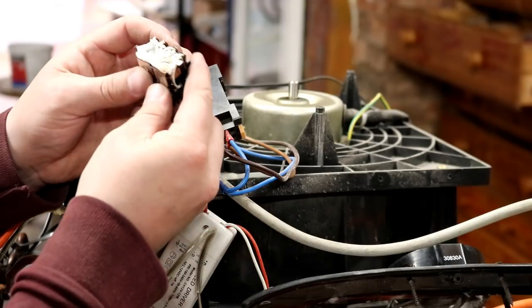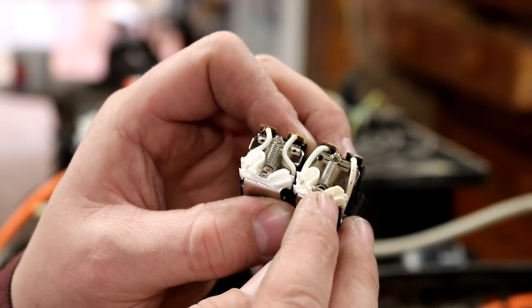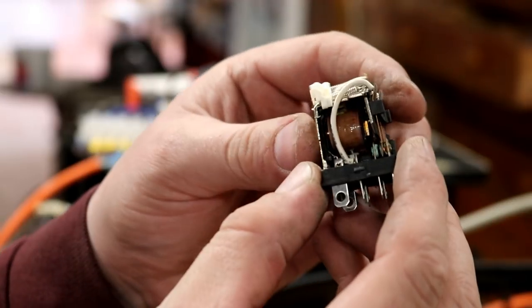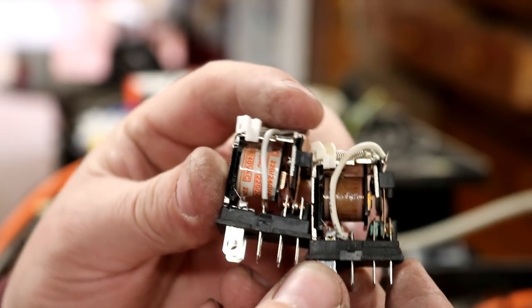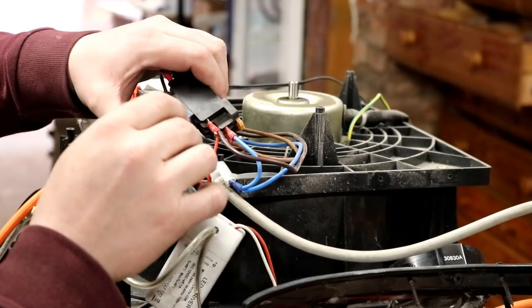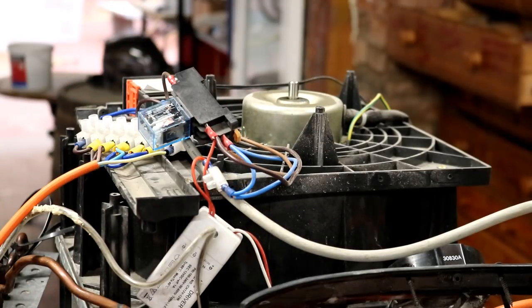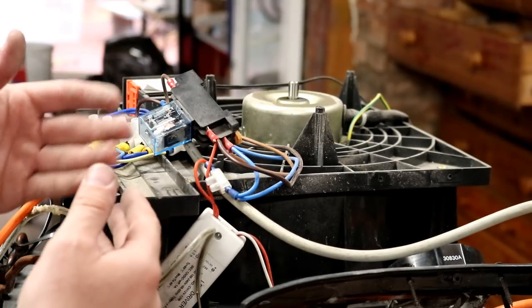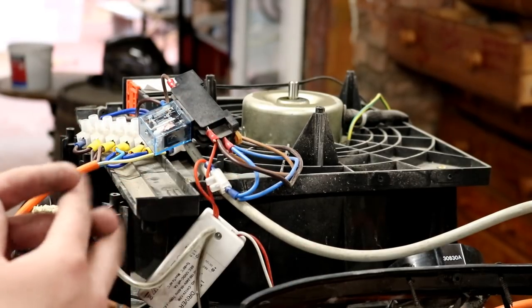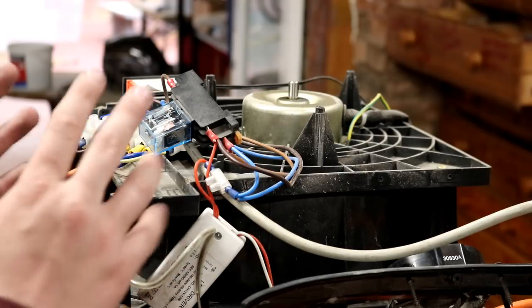You can see on this one, if I get close up, you'll see that one started to go brown there. Also, another reason I'm changing this is because there's some verdigris forming on the contacts, whereas this one is a brand new, nice and shiny 240 volt — or 220 actually. These relays are like two or three pounds and this is your first point of failure generally if something goes wrong with anything like this. We'll be using these relays on the build to control the motorized valves, switch the pump on, and everything else for the cooling jackets. That'll be another build — quite a build as well. I've got lots of these to order.